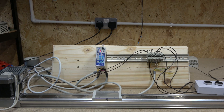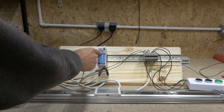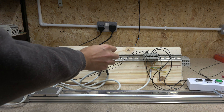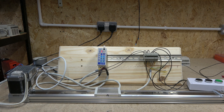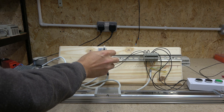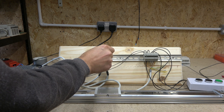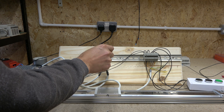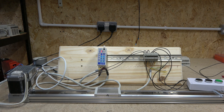Hold the buttons to restore power. If you click SET it won't move because it's already at the learned position. To demonstrate the position has changed, send it back to position two, click SET - it goes to position two. Then go back to position three and it will stop exactly where you taught it. You can do that for all the positions: four, five, six, seven, eight, all the way up to E. That's 14 positions total, with 12 of them teachable.